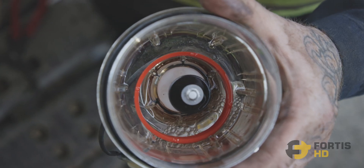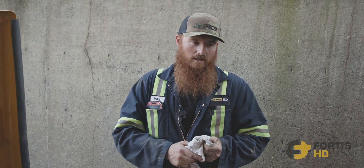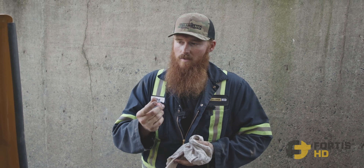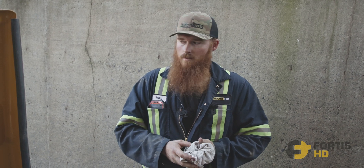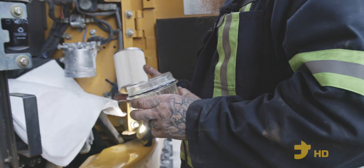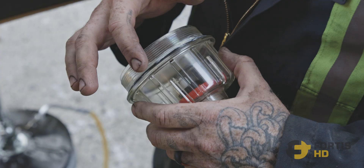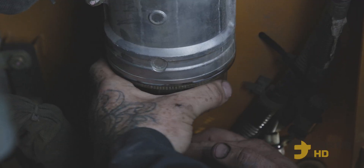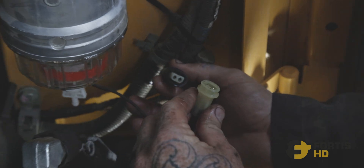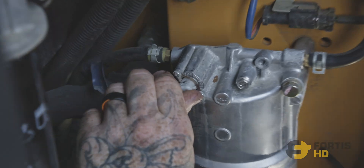That's your water and your fuel. Make sure once you remove your filter and the bowl, you clean out the sediment bowl and replace the necessary O-rings — they're sometimes on the water drain on the bottom and on the O-ring on top of your sealing surface. Now you've got a clean sediment bowl. Install the new filter, pop it in there and it'll sit there with the seal. Order the O-ring for it because it's good to replace them every time. Hand tight. Make sure your drain's tight. Reconnect the water and fuel sensor connector, clean that up, and turn your shutoff on.